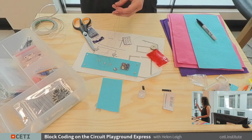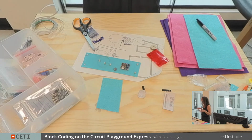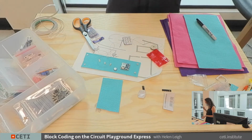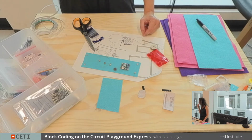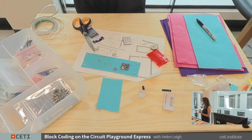If you're sewing something and you don't want a short circuit, you need to watch out for those fibers, because those little hairs can expand and touch the next path over, and suddenly you're wondering why this isn't working. It's because a microscopic bit of conductive fluff is causing a short circuit. I have two very practical ways of making sure that doesn't happen. Number one, if you're using a fluffy thread, I put a spritz of hairspray on it after it's done, then smooth the hairs down, and that tends to stop short circuits if I'm doing fine work.